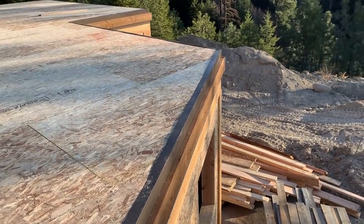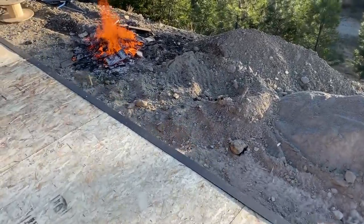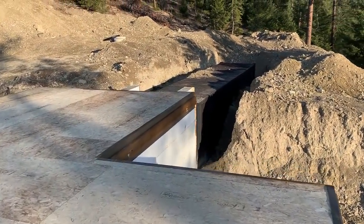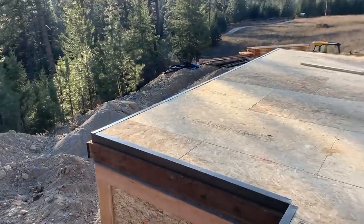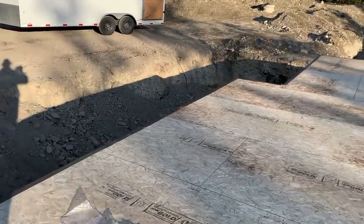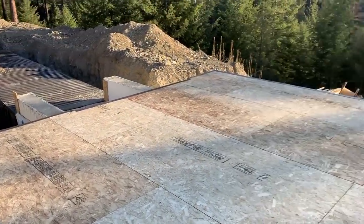That two-by-eight pressure treat is to carry the porch floor, so we got that on top of the metal all the way around where there's going to be a porch deck. Isaac is doing cleanup, burning scraps and sawdust. We got the front side all done. The porch deck extends from that point right there and goes around the front, ending up at the point of the angle. We got the rim installed all the way around. Finally got room to move the trailer up here — there was no room before.